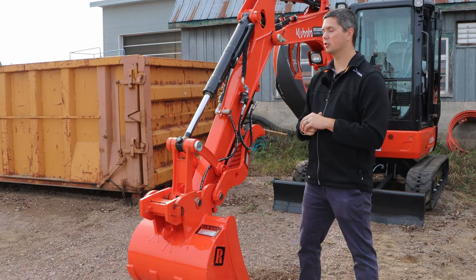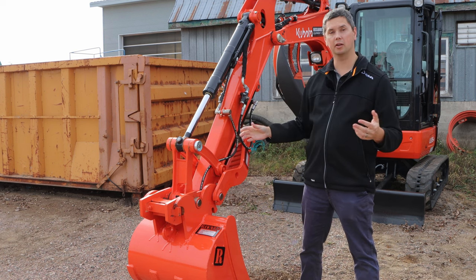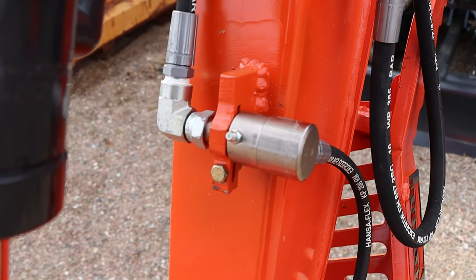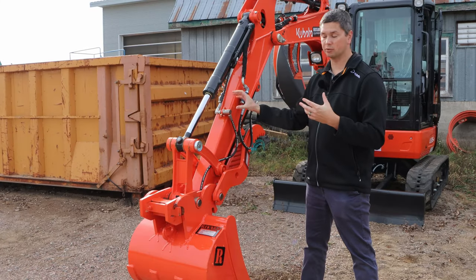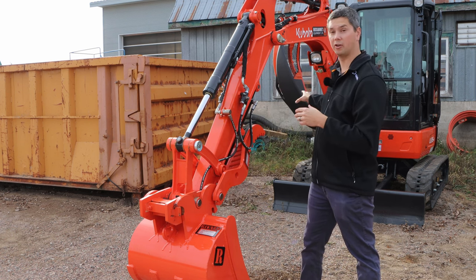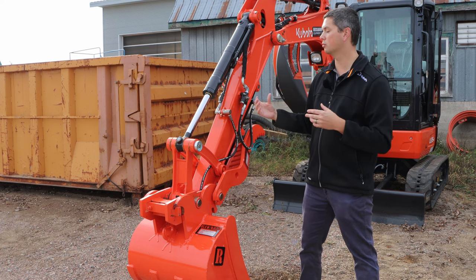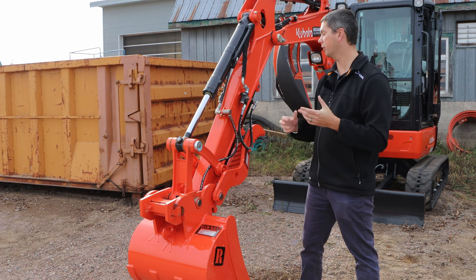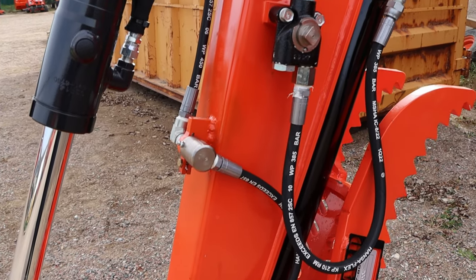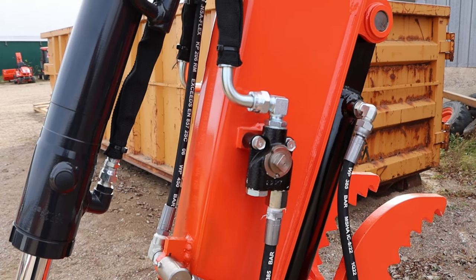One of the other big differences you're going to see here is this tab welded on here with a hydraulic swivel fitting. Very unexciting, not really much to talk about, but it is a big difference from what you're going to see on the H&H one. On the H&H, you're going to see a nice big valve here, held there by a welded-on tab. For the Rivard one, they've taken that valve and moved it inside underneath the cab, way under that hood, where it should be. It's not going to get damaged, whereas we have seen it on the Kubota one, where it has been damaged or lines are caught there. Whenever you're dealing with sticks and stuff, they get everywhere, so the less moving things you can have out front, the less expensive things you can have, and you tuck them where they should be, the better it is.